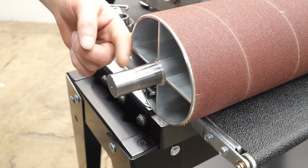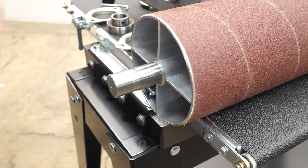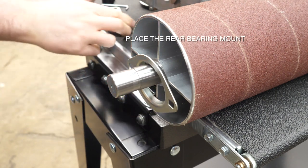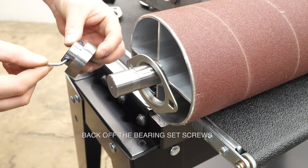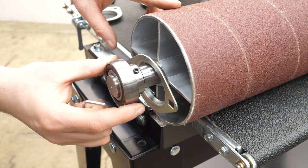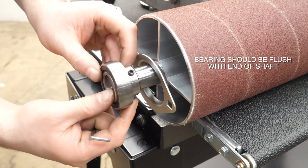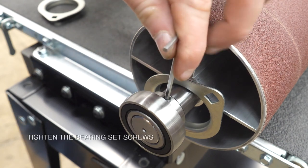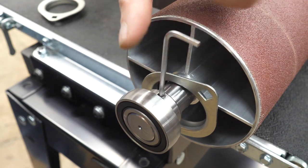Reverse the head and bring the shaft end down to the other side of the table and block it up again. There's also a mark on this end, so clean off all dust and debris. Grab the bearing mount and the bearing, back off those set screws just like you did for the coupler, then slide the bearing into position. It should be just about flush with the end of the shaft — there's a mark at the end you should not go over. Tighten those set screws down really well.